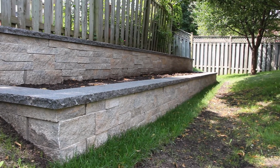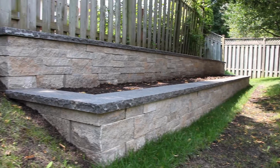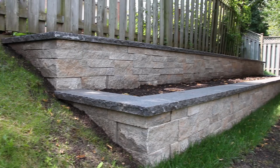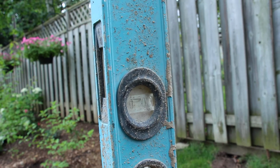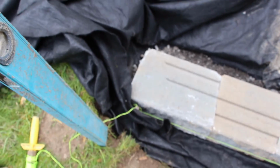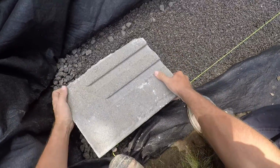This is just enough to give our client garden space for their retaining wall. So we knew our starting point was square to this fence post, and then we were running 31 feet afterwards to the final fence post. And when our fence is much higher than where our base material is, so that we can't really run a tape measure against it, what we'll do is we'll take our 8-foot level, we'll make it level vertically, and then we'll just measure against that fence post, and that'll ensure that we're super accurate with where our pin for our string line is gonna go.